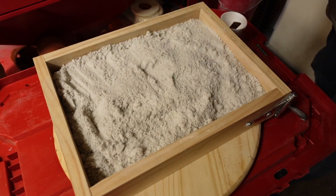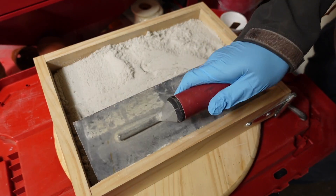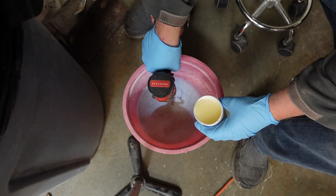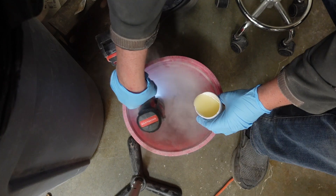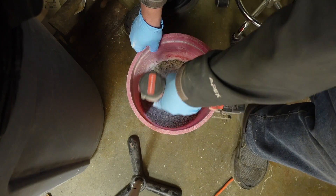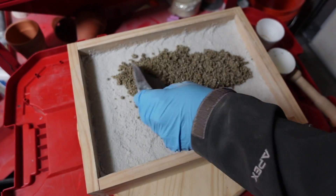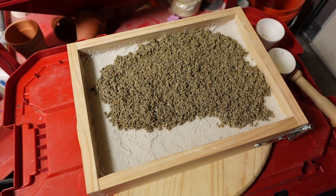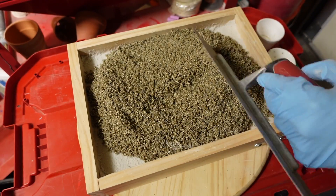I'm making the other side now — again spreading out that surface sand and trying to even it out as best I can. We're mixing up the second batch, the top coat of the heavier grit sand. It's key to mix in the epoxy really slowly — that gives you a nice uniform mixture in the sand. Sorry about the camera focus going in and out.